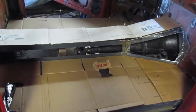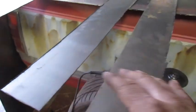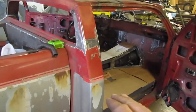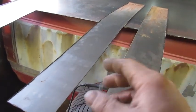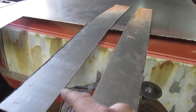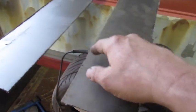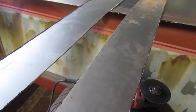I'll start with these two outer edge pieces. I laid them out and cut them both — they're exactly the same. I cut the first one and the other one fit exactly the same. There's actually a quarter inch downfall forward inside that cab, so it's four and a half on one side and four and a quarter on the other. The floor is actually level but it sits in there that way anyway. Now I'm going to buff the edges off — I cut them with the razor wheel — and then go from there.